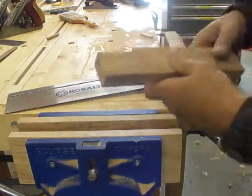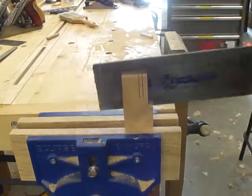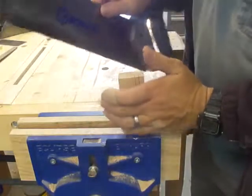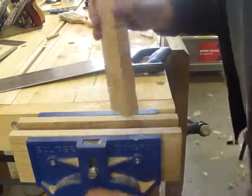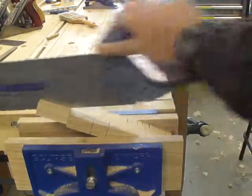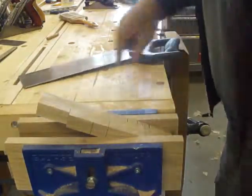So, you know, I take a saw like this, and mostly if I'm going to do some long ripping, if I'm in a piece vertically like this, now I'm going to do a lot of ripping. My capacity only goes to the back. So at most, when I say ripping, I'm talking a lot of times about joinery for this saw. Yes, you could put it in and keep going and cut farther and farther down. There's ways you could cut this piece and cut way down into the piece on an angle, especially if you were cutting in the correct angle. Could I keep going? Sure. But in general, that's not what I'm going to do with this saw.